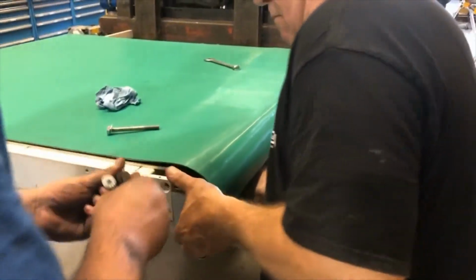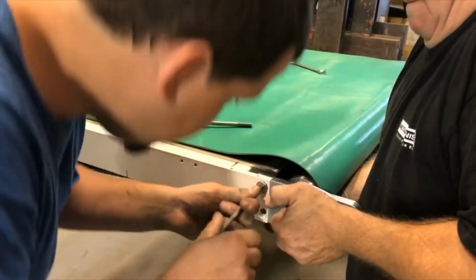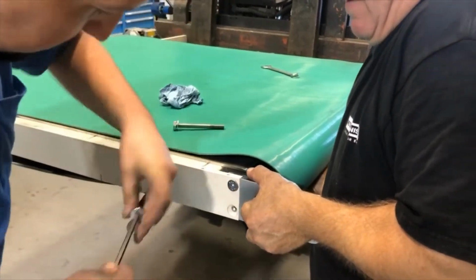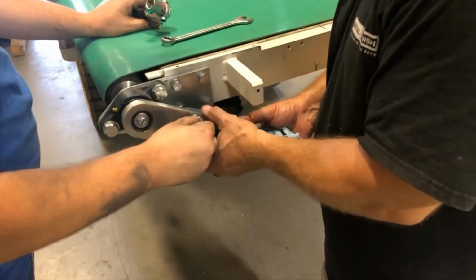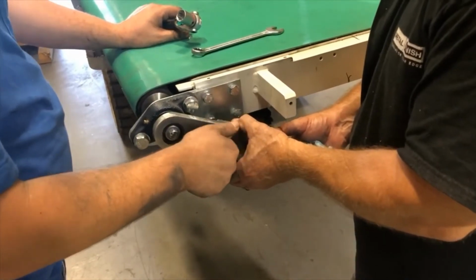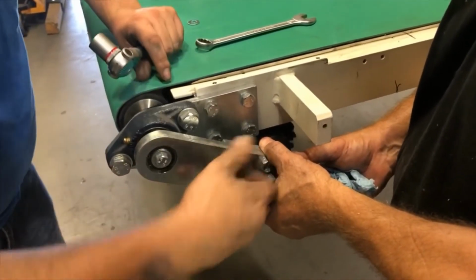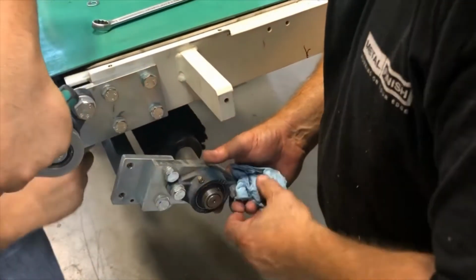And the next step, once you have the conveyor belt back on, and this is really a job for two people, the bracket goes back in with a roller. Then we reattach the bracket for the cleaning brush. Now make sure you pay attention to, let it down, the conveyor goes over the brush through here. Through there, yeah, right. A lot of mistakes happen there.